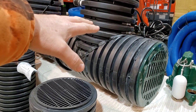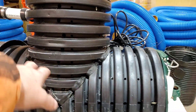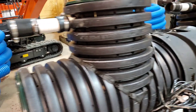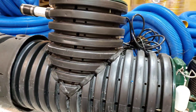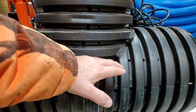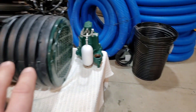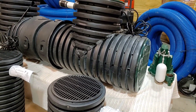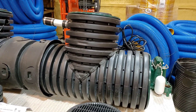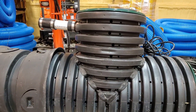This is a 24-inch unit, so what does that mean? This is for a 14-inch trench — you can't go any deeper. This is one of our 24-inch tall duplexes. The trench can be 14 inches, and that leaves you 10 inches, so this unit sits 10 inches deeper than your 14-inch trench. DIYers do not have to dig as deep as the contractors do.